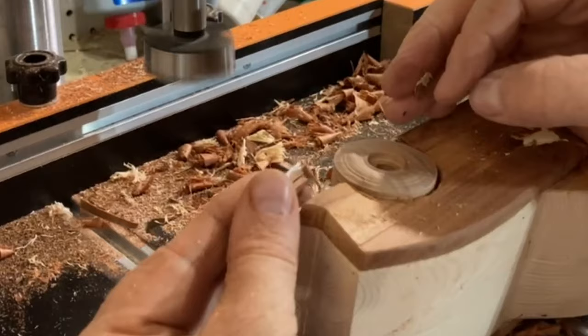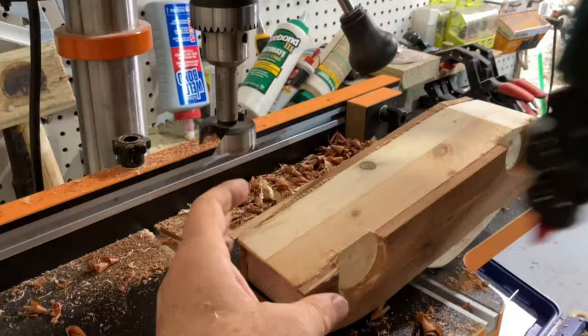Here's where I got a little ahead of myself and broke one of the cedar cutouts. But a little glue and some pin nails, and we're back in action. Keep in mind that when you're using cedar for smaller projects, it is a really soft wood and it also cracks really easily when it dries out. This cedar came out of our 1926 house, so it's definitely got some age on it and it is dried out and cracks really easily.